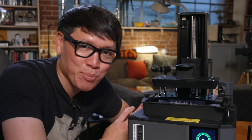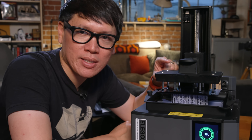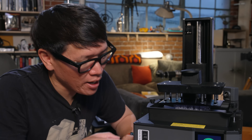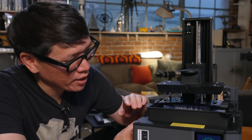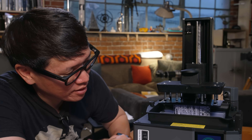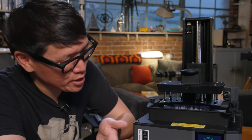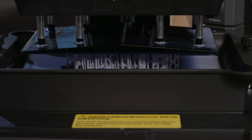This tilt mechanism is pretty cool because there's no retract process on the Z-axis itself — that's what makes this a speedy printer. Typically in a resin printer cycle, the resin is exposed by that UV light for a set time, then the Z-axis moves up and the build plate has to separate from the film, which is one potential point of failure. By moving that retract to this auto-calibrated tilt of the vat, the layer cycle times are very fast.